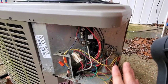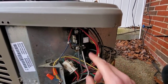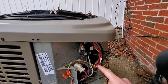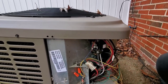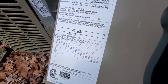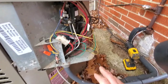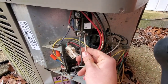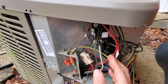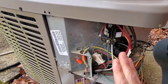You do need to have an HVAC technician — a professional — do this for liability and safety reasons. There are also other components like the contactor that should be checked to make sure it's working properly. The contactor sends voltage to the compressor, so if there's carbon buildup and it's not sending the right voltage, that's another issue. Also, when checking max overcurrent protection on your service facts, it's very important — max fuse or circuit breaker is 30 amps. Make sure the breaker size is right and the wire size is right, because incorrect wire size can cause issues with the compressor and lights dimming, and is a safety hazard. For 30 amps, number 10 wire is what you need — and that's perfect.